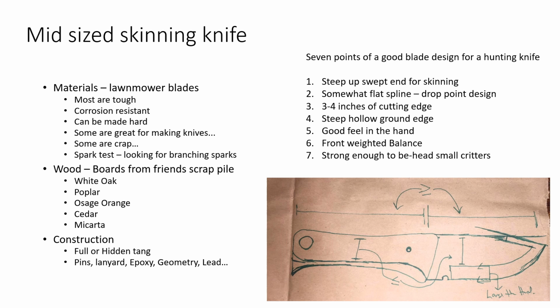The bottom, I want it to be pretty much the same as the top, with just a subtle pickup, so that the back and the front are both bigger than the middle, so that you know where it's at. You can index it in your hand. If it starts to slide forward, the handle gets bigger. If it starts to slide back, the handle gets bigger, but not so much that it's obvious and looks like a dog bone or anything. I want it to be a subtle sort of feel.